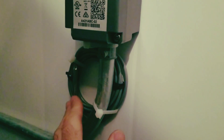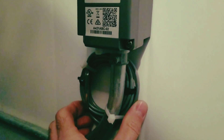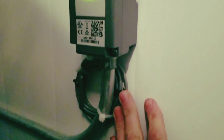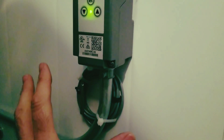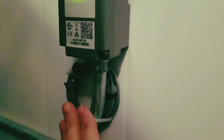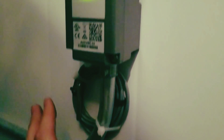This sensor wire is just over six feet. I have to wrap it up and leave it here as neatly as possible because the old mechanical stat had the sensor sitting up here — we have to keep the sensor in the same vicinity. This is a pharmaceutical building and there are procedures written up specifying the sensor location, so we've got to leave it here.